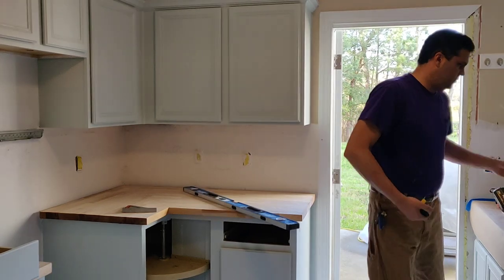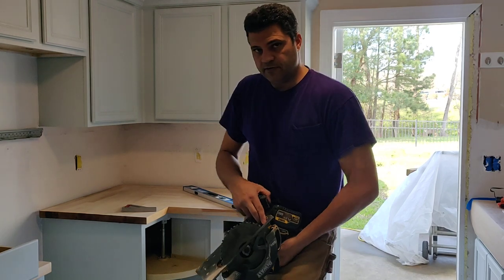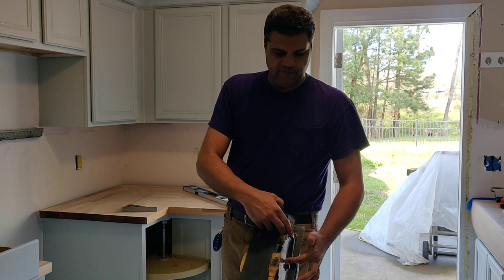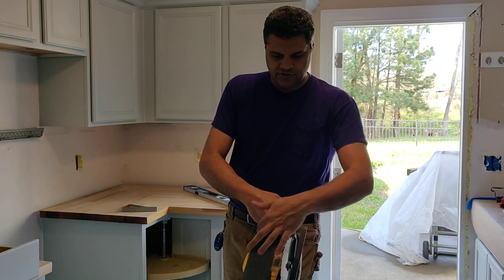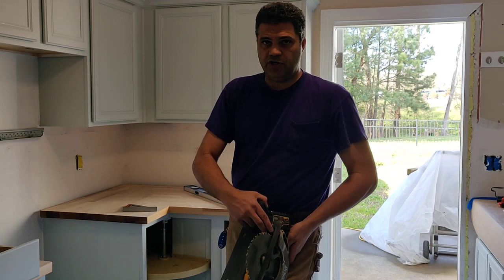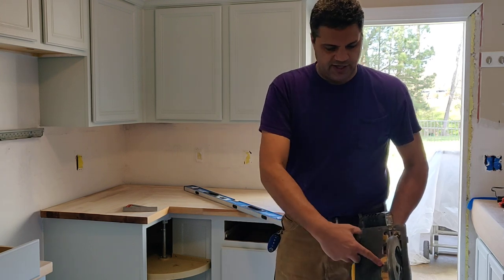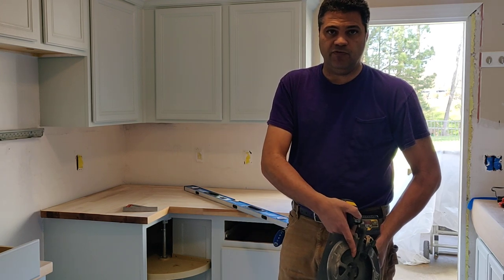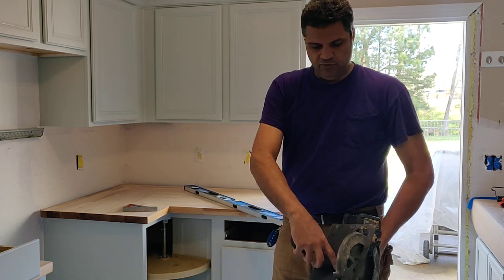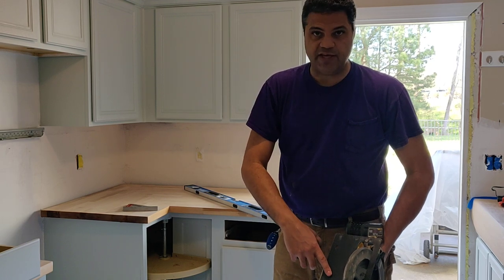And then you measure on your saw the distance from the blade to whatever edge you're cutting. If you're cutting from this edge to here, then the distance is shorter than this edge from here to here. But you can cut in either direction, right? You want the small section to be on the piece you're cutting off if you can. The piece that falls to the ground, you want that to be on the short side. The long side is the side you're going to keep.